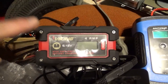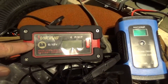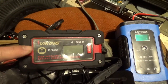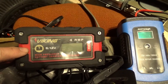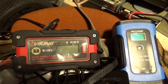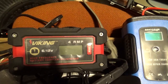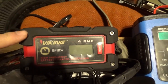I've had some luck recovering these batteries with this Viking charger. The only problem is if your battery isn't like 11 volts it will not click on — it won't even try. If your battery voltage is really low it won't try at all. If your battery is only a little weak, it goes to a pre-charge sequence and you might recover it, you might not.